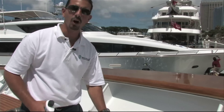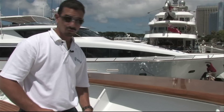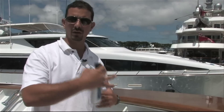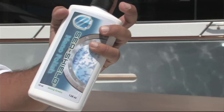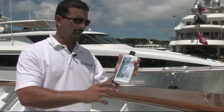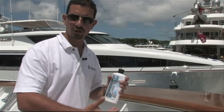We're going to do an Awlgrip buffing. Contrary to what a lot of people think, Awlgrip truly is not buffable when it's new. You kill the clear coat, it goes into a stage where it destroys itself with UV, and the clear coat doesn't come up easily or doesn't come up again ever. But we have found a way to restore Awlgrip, and one of the products we use we call Nano Polish — it's a polish with no protection that has lubrication and doesn't create heat to a point that will burn through the paint.